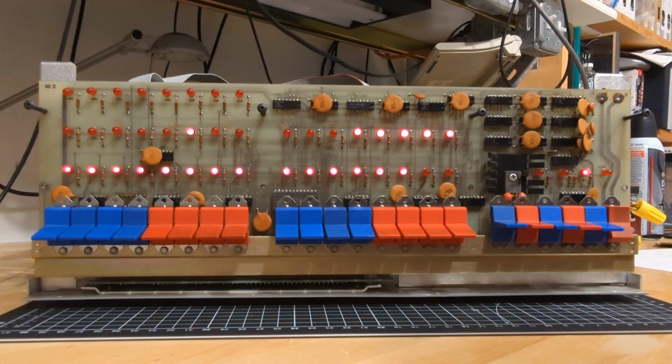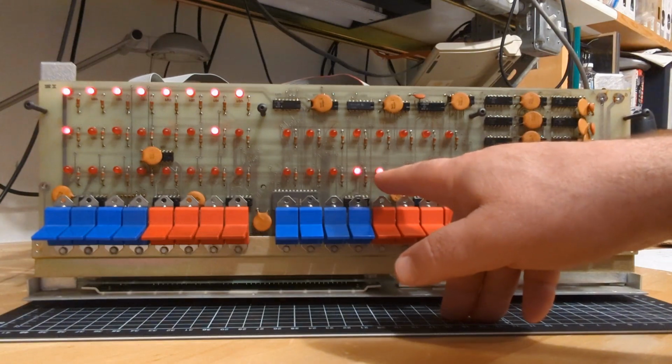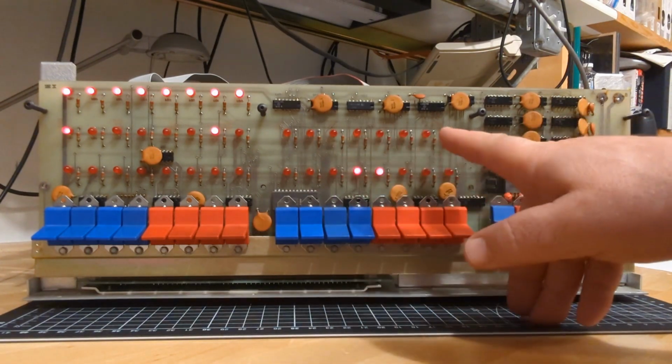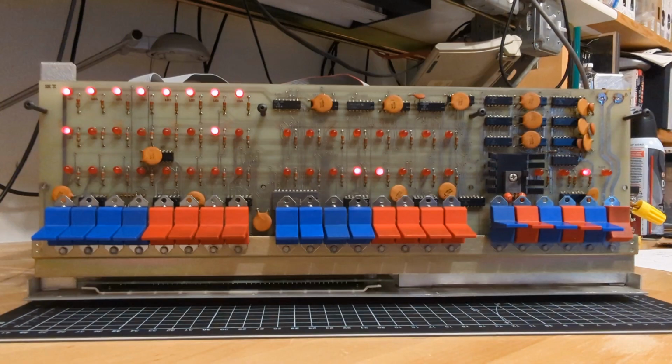The next time I click this, that should go off, and we should be reading a machine cycle number 1 from a byte in memory in whatever that restart address would have been, like, I don't know, 28 or 30 or something like that. So the next instruction should be the execution of the restart handler. This address is a 1-8 in hex, and it's got a null, okay? A zero, a no-op, right? So what happens now? We got this guy here and the one over there.